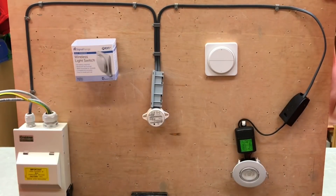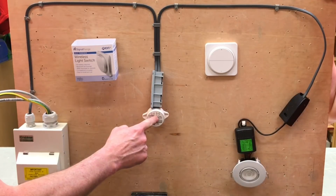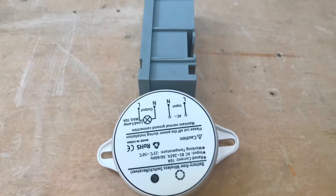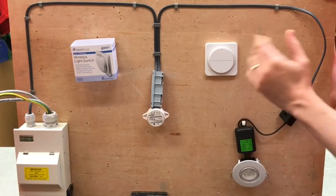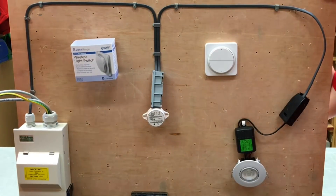I think we've found very limited negatives about it. Maybe one: this would be positioned in a ceiling, and maybe during an insulation resistance test — we've got loads to remove — but are we going to be fully aware of this device being maybe behind a downlighter? Hopefully you're following reasonable precautions when doing insulation resistance testing. If you're not 100% sure you've got all your loads disconnected, it's a good idea to test at 250 volts as a start — that should show if something is still connected in. But to me, that is just the way the electrical industry is going — it's something we need to be a little bit more careful about when doing IR testing.